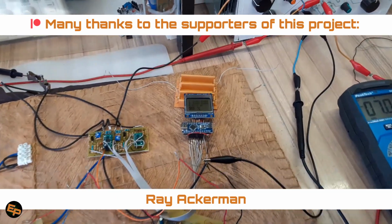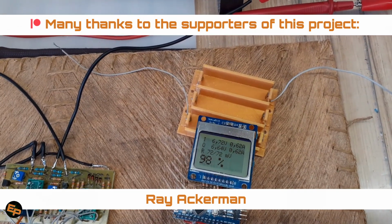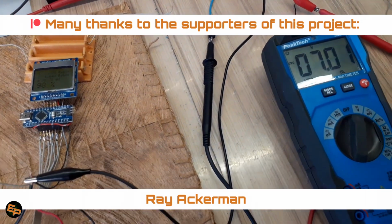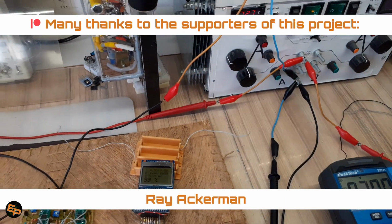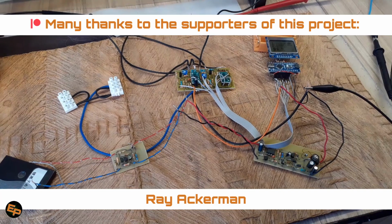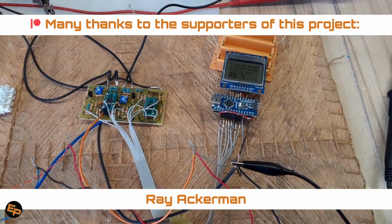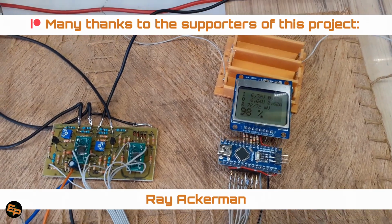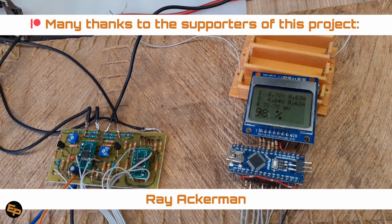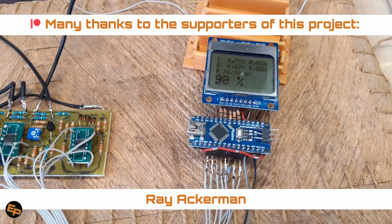So the idea is that I wanted to design and create myself a sort of multimeter that is able to measure 4 things at once and calculate the efficiency of DC-DC converters. And this is what I'm showing you now on screen. It's not completely finished. I still need to design and 3D print a plastic case, but as far as the electronics are concerned, they are finished.